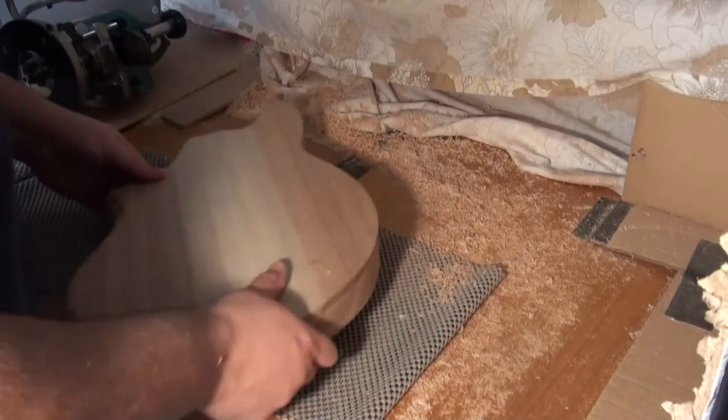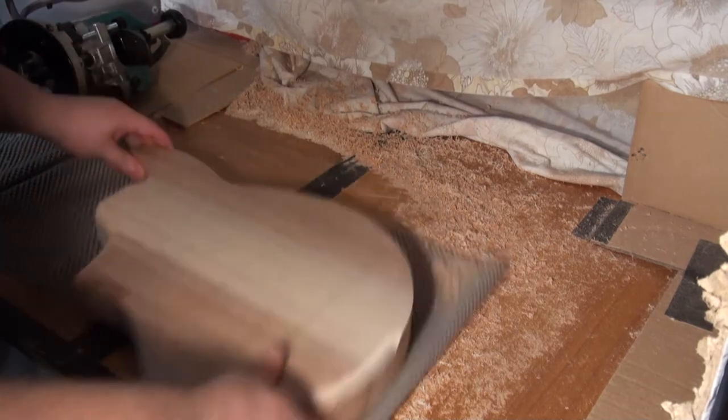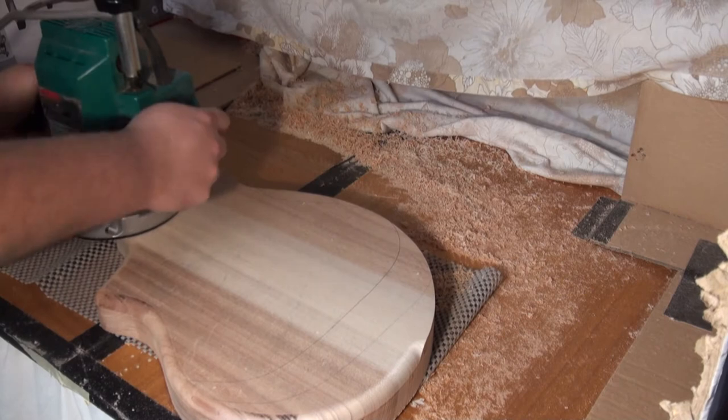The main problem you can run into when cutting with a roundover bit like this is that if it is not set within a specific tolerance of height, you will end up with a line created by the inside edge of the radius.